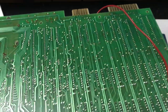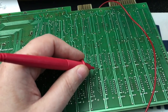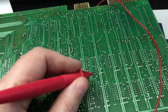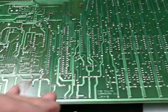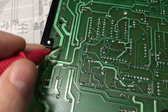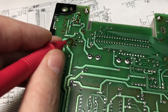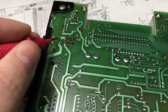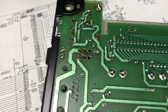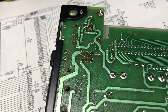I've got my meter hooked up to the five-volt input on one of the chips. That's the main five-volt rail — all of the five volts for the logic chips come off these branches here. Following this line all the way around, this is essentially the main five-volt bus. We still got continuity here, still got it here, keep going all the way up. And then here's the output of the switch in question — we don't have anything here. But if we take the tip of the probe here, we got continuity there. So what it looks like we're dealing with is just a simple cold solder joint right here on the switch. I'm going to completely desolder and remove the switch, re-solder it, and see how we get on.